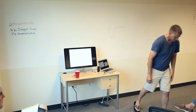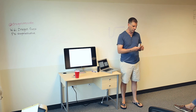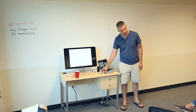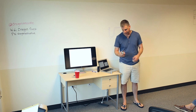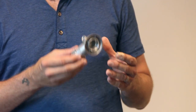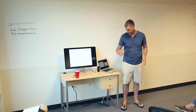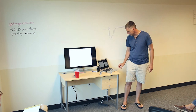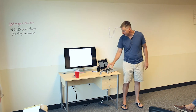Pass these around. But basically, if you can't get enough strength out of an injection molded part, then die casting is a great thing to consider. So essentially, you're moving from plastic to metal. Moving from plastic to metal, exactly. And it's not only mechanically stronger; it also offers a much broader range of thermal conditions it can survive in. It's also a lot more UV tolerant than plastic might be. But you can imagine, connectors, housings, gears; those are all great things to die cast.